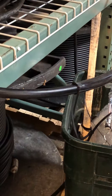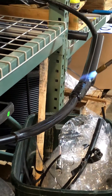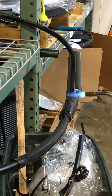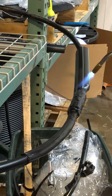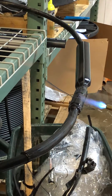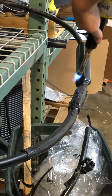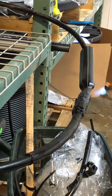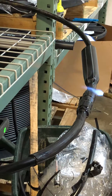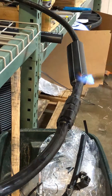Usually you'll see a little goo come out the back — that's a nice good seal. On the other piece, once you get started here, it doesn't matter if you get this really hot, but when you start working down the cable, if you can get an angle where you're really heating the boot and not the cable, that's better — because you can overheat the cable and the black jacket will start to separate.